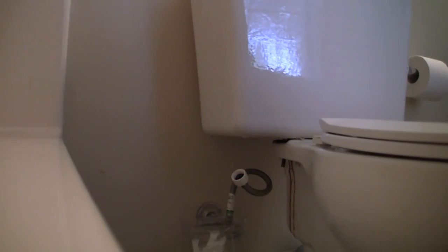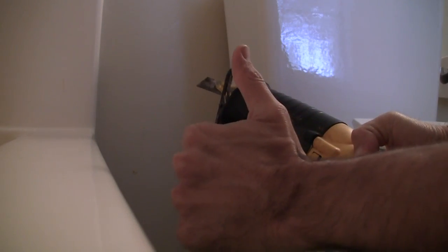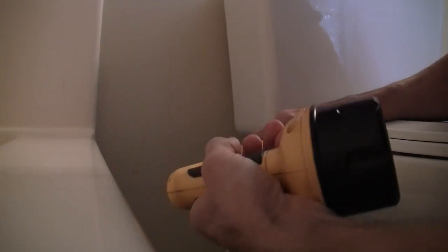I used that method once — never will I use it again. The easiest way to cut rusty toilet bolts is with a sawzall. I use a cordless 18-volt DeWalt with a metal cutting blade. Many toilets will have just enough space to get that blade in, and you want to be directly on the bolt thread, not on the nut.